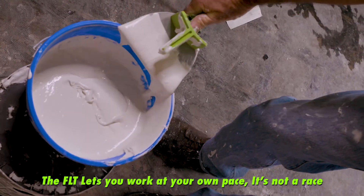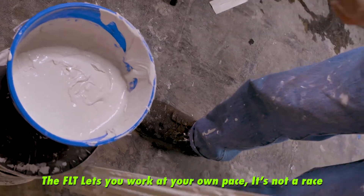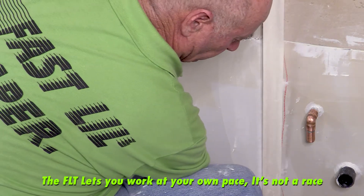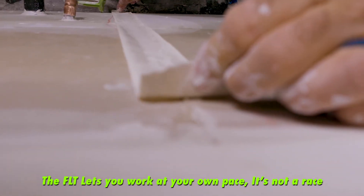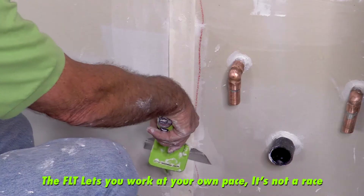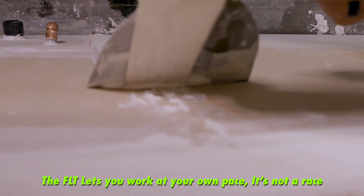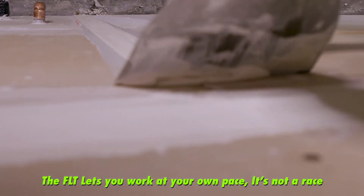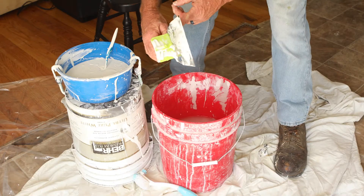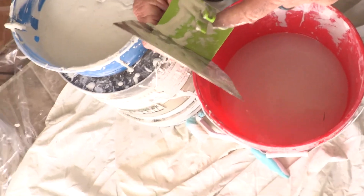See, there's enough on there. Right after this I'm gonna put some more in the bucket. I want to start this one from the bottom and center it on both of those joints and walk it up. About every five to eight pieces of tape that you run through, sometimes the teeth will build up.